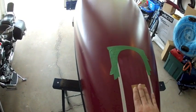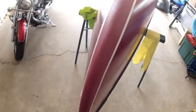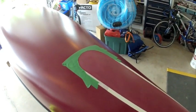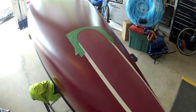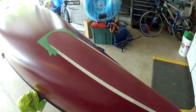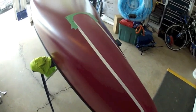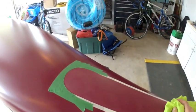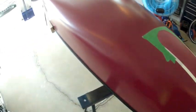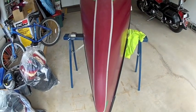I don't want to bore you with a 20-minute sanding job, but once I get both ends sanded I will show you the next step. After about half an hour of sanding using that 60-grit sandpaper — being careful not to rip the edges of the tape, there were a couple of nicks I put in the tape but I just patched them up. I used a dry rag here just to wipe off all the dust to make sure there are no shiny spots. Here's the other end of the canoe — same thing.